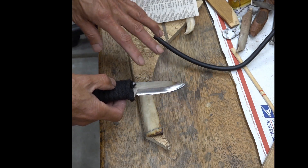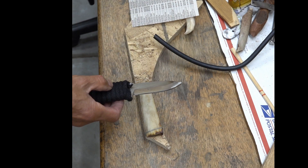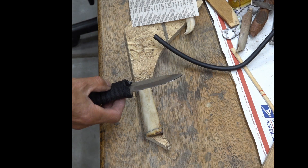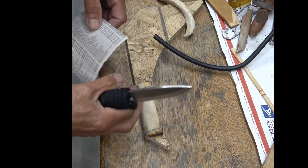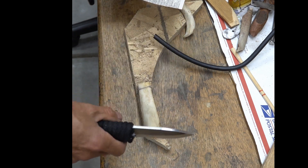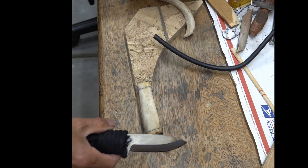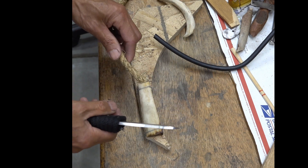This bevel is a little convex, but right now this edge is at the V, 15 degrees per side using EdgePro. It's not super well sharpened, but it will slice paper good enough. And I'm going to do the sanity check.